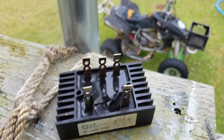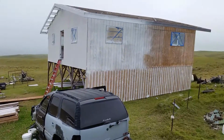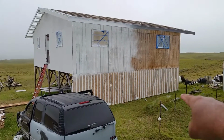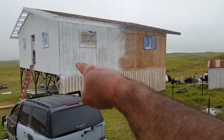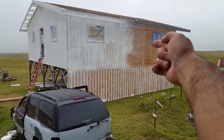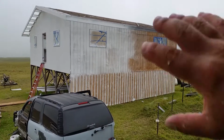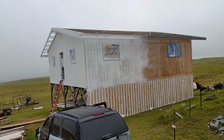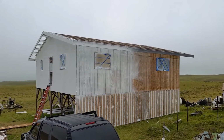So, anyway, guys, hope you guys are having a great day. And I'm hoping the weather clears up for me, so that way I can get back on painting the house. Because I did all the lines on the bottom and on the back side that goes all the way down the other side of the house. So now I got to do all the lines up here, then take the corner and go around and do all those lines. Then once all those lines are done, it's all a matter of just rolling the whole wall and finishing up painting our fascia all the way around. And then basically it's primered in. Then I can caulk everything and then get ready to actually put the final color paint on here.